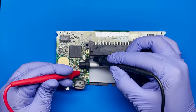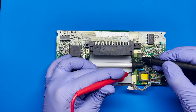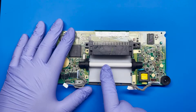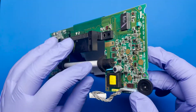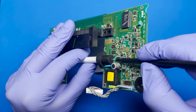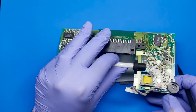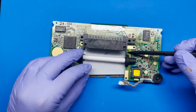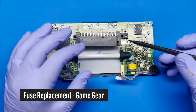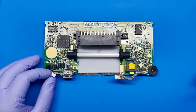We'll start with this one — this one works, you can actually hear it. And then this one we're not getting anything. So what we're gonna end up doing is first removing — there's actually a connection here that's located right here. We're gonna desolder that point and that should release it from over here in the back, and at that point we will get access to this fuse here and we'll start replacing that unit and then test it again to see if that works.